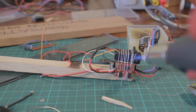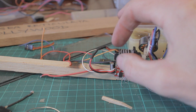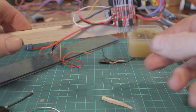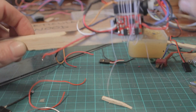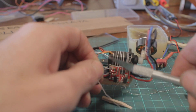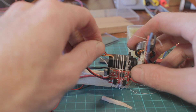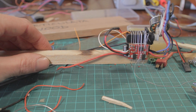Don't use a blowtorch to shrink the heat shrink because it might melt your threads. But you get the idea — you end up with a really nice, lightweight and efficient yaw mechanism. It's only suitable for really small motors; these are 2300kV motors that we generally don't run on anything bigger than 3-cell — 3-cell is almost the limit. The weak point ends up being the servo arm, so keep plenty of spares. If you do have a breakage it'll break at the servo arm first rather than bust the motor or strip the gears in the servo itself. It's lightweight, incredibly lightweight, and works pretty well.